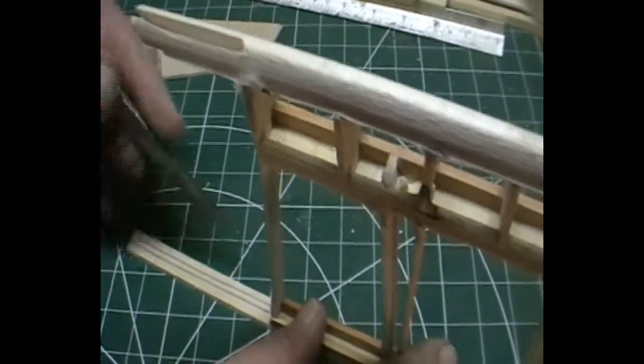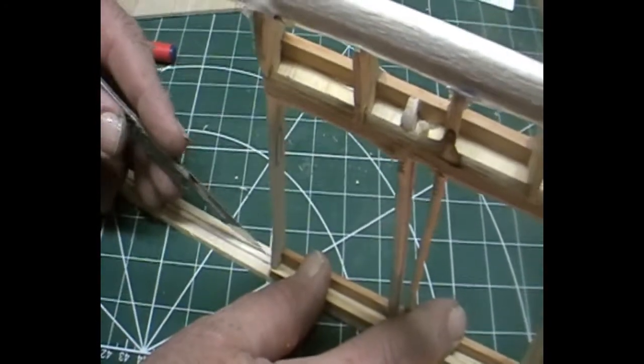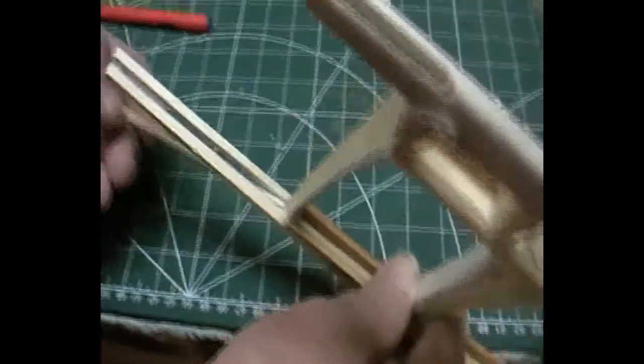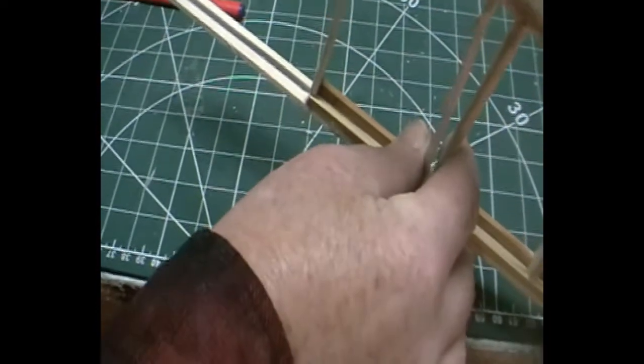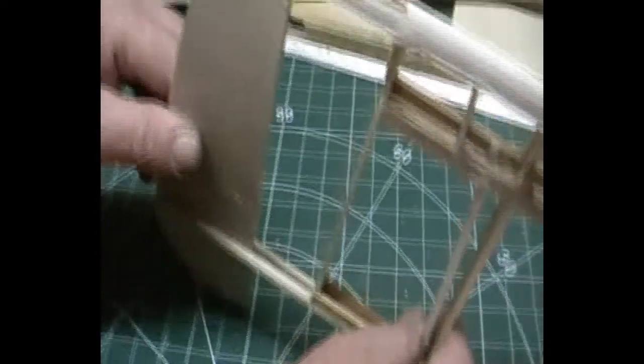And then you run your blade down it nicely like so, just track it first time and then cut deeper, because that allows the blade to follow the wood. And then you pack it out like so. Then you offer it up to test it to make sure it's okay. Here's one I made.